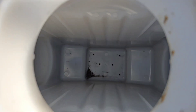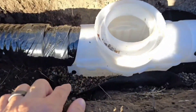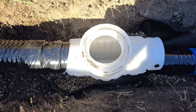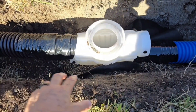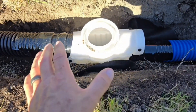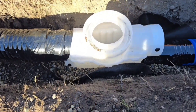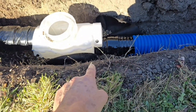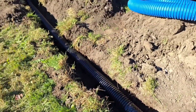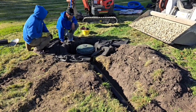The holes they drilled — you can see the holes in the very bottom. There are guides in the bottom of this so it's easy to drill out those holes. You don't have to drill them too big. As long as you have some pea stone under the catch basin, the water that's left in the septic box will leach away — it'll go into the pea stone and travel through that vein and come into contact with more soil. If you just put this septic box down without pea stone under it, you're going to have trouble getting that box to leach. Remember, you're tied in low and asking water to climb out the discharge line. We don't want to fill this dry well up with tree buds, tree seeds, and all the heavy things we can filter out by using a septic box.